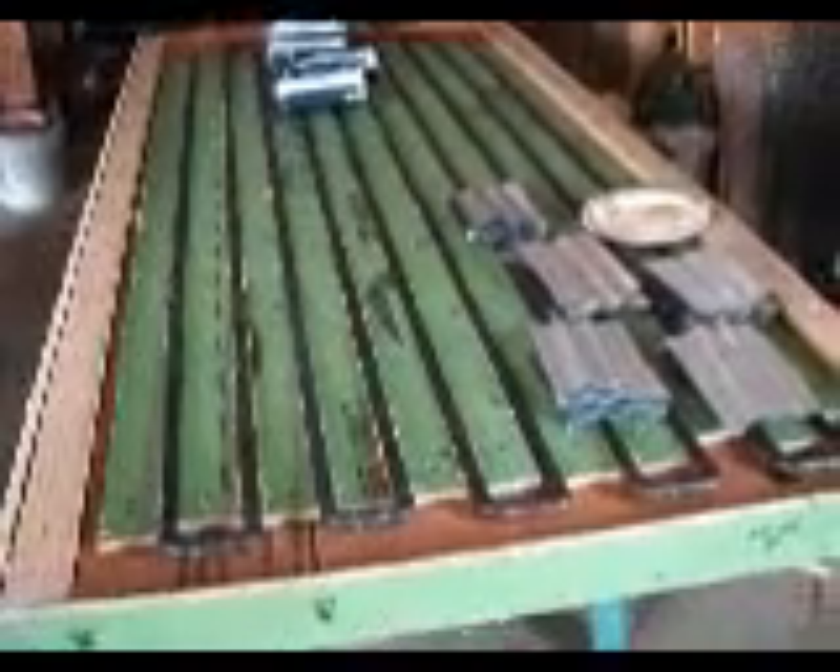This is my rendition of the solar water heater. What I've got is an old closet door, some cardboard insulation, and strips of zip sheathing in between my pipes — my copper pipes. I've got 60 feet of pipe serpentining back and forth all the way to the top. These pipes are going to fit right down in the channels I've made with my sheathing, fitting right down in there perfectly.